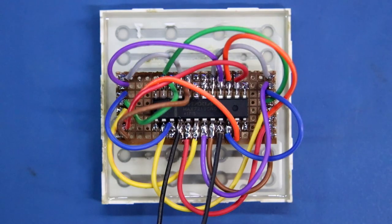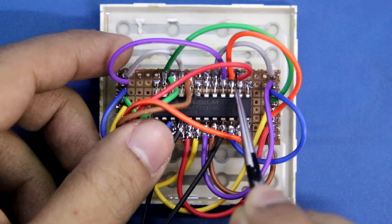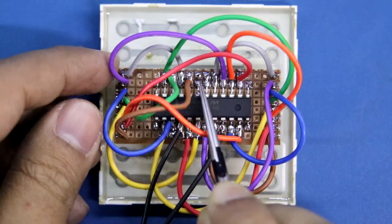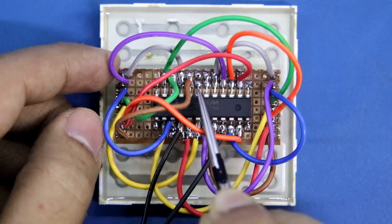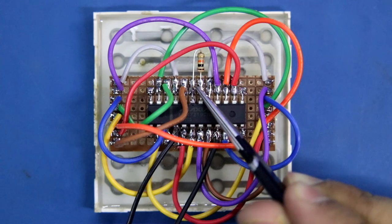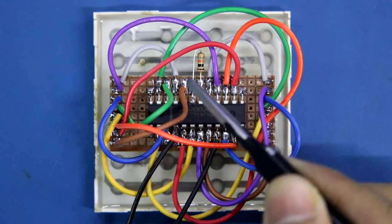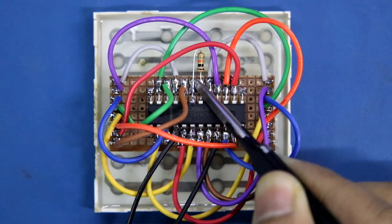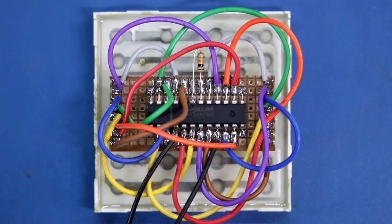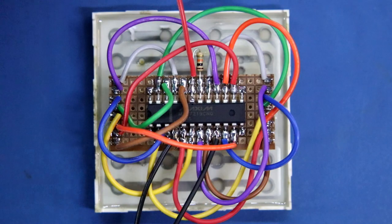This is connected to pin 13, 14, 15, 16, 17, 18, and 19. In between pin number 18 and 19, we have to connect a 10kΩ resistor — here I have connected it. Pin number 19 is the positive VCC, so with this pin I will connect a red wire. As you can see, I have connected it.